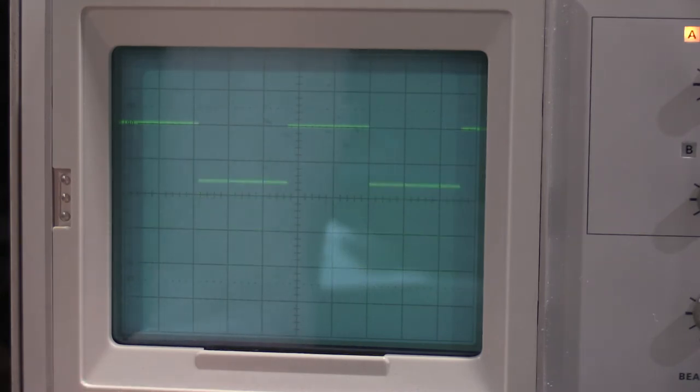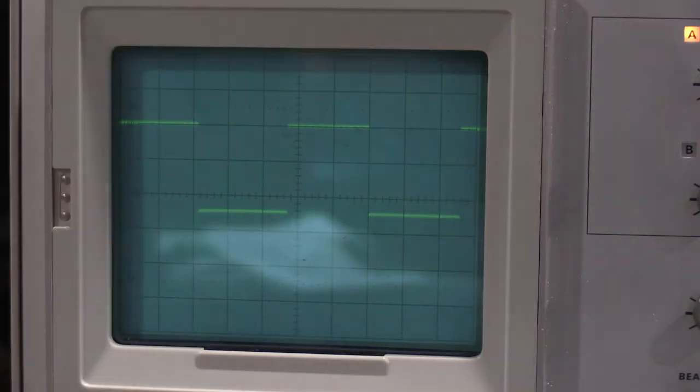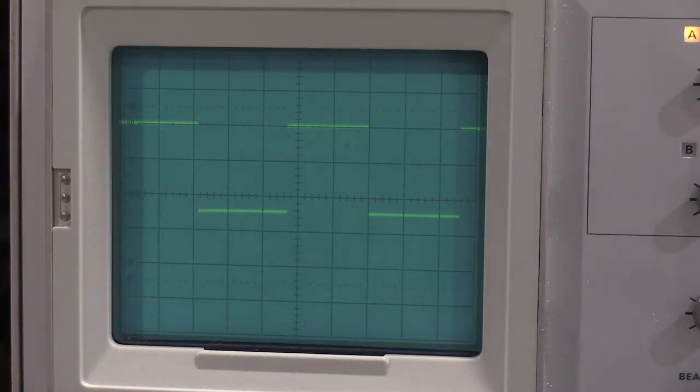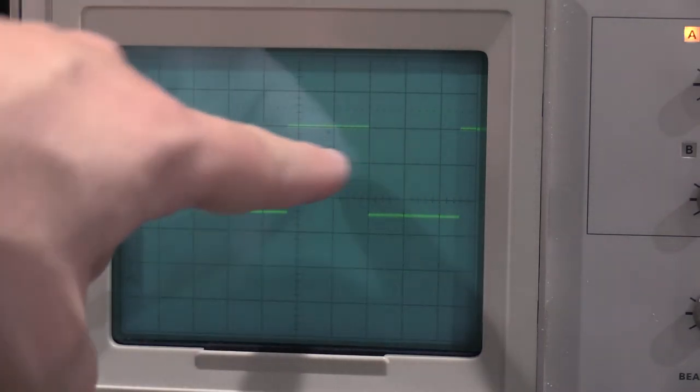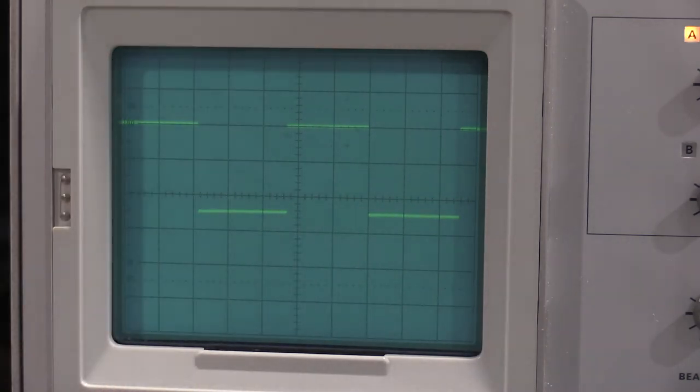This one looks like it's in a lot better shape than the last one I did. The last one I did, the high frequency calibration was way out. These were curved down like this. The compensators were pretty awful, or the compensation was pretty awful. But I was surprised. I thought it had problems, and it actually ended up compensating pretty well. So everything's nice and solid. I think a good flushing with alcohol and letting it dry will be a good start.